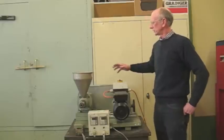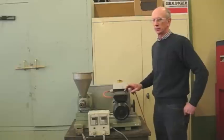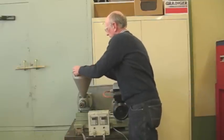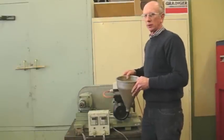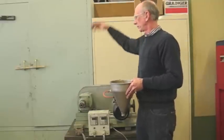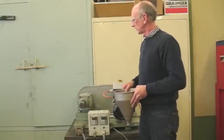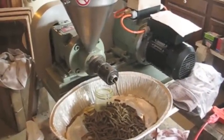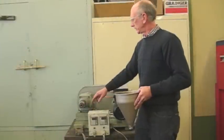It's a typical screw-type press with a hopper above it. For longer-term running without constant feeding, you'd want a larger hopper feeding into this one. The screw brings the seed out, presses it, and the oil drips out. Things that are adjustable: you can adjust the tip size so that the hole the meal exits is smaller. For canola, use a smaller die around 5mm; for sunflowers, maybe a 10mm die.